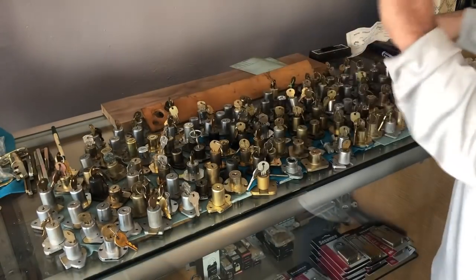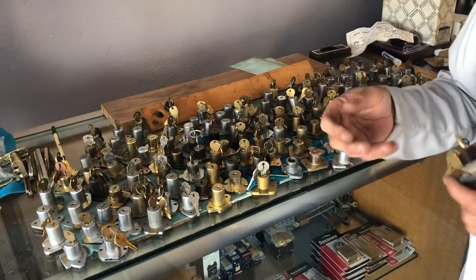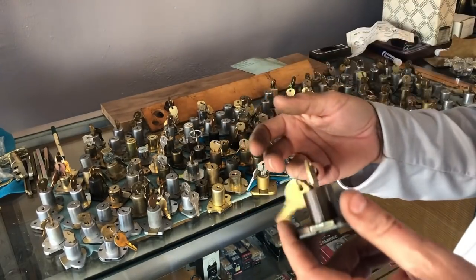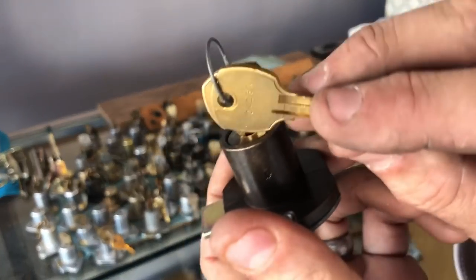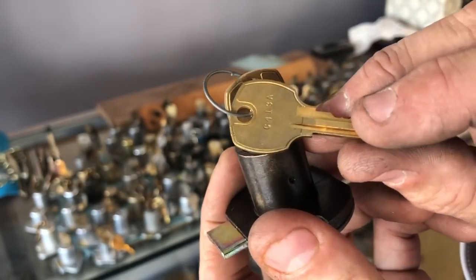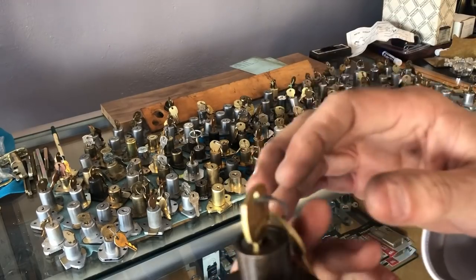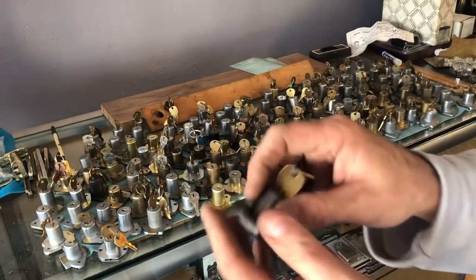However, before you do any of that, most locksmiths have that ring of keys. That's the C-346, C-413, C-415. There were quite a large number of these desk locks that were matched up with cam locks as well that were these keys. So always take your 346, 413, 415, especially on the ones that are national.